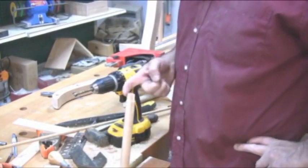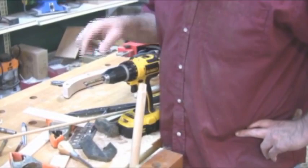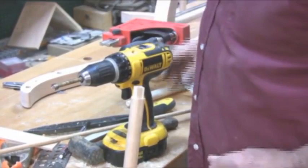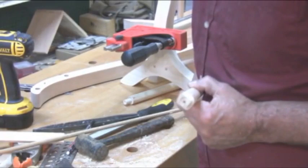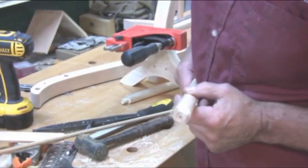Remember when it was square and when we were setting up our dado, we marked the center and drilled a little mark point to give us a pattern. Now, I've done the same thing here on my tenon. Common sense says it would be better to do it while it's square and do all of the ends. That makes sure you're in the center, and it also gives you a reference to rasp to, so that you know exactly how to get it round, so you can start your bit, or just go ahead and rasp it on out.